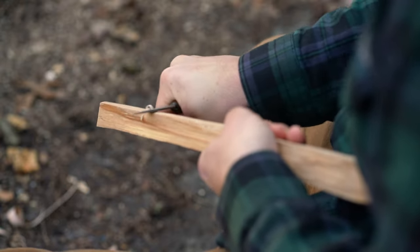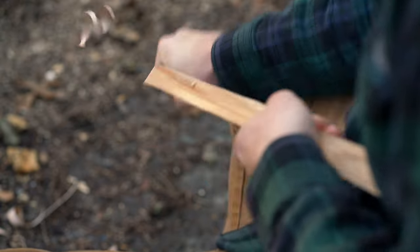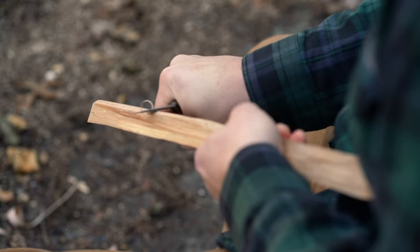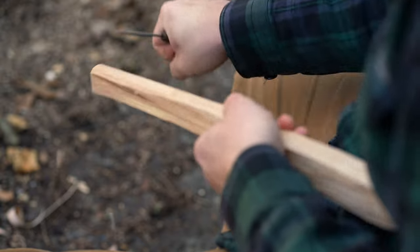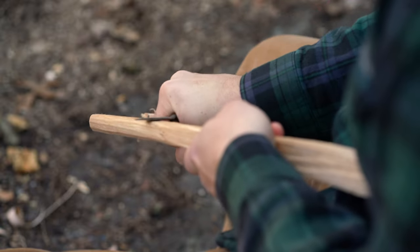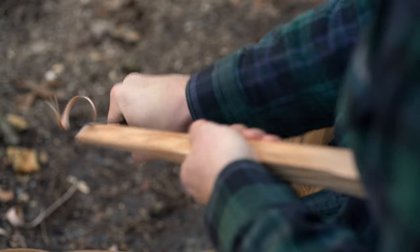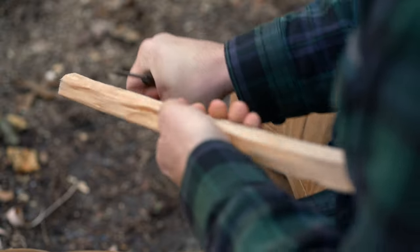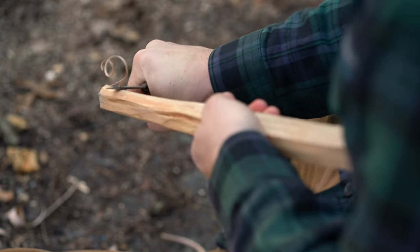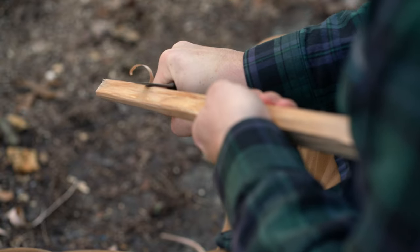A few things to remember: if you are struggling to make your cut, chances are you either have a dull knife or you're trying to take too big of a bite. So it should always be pretty nice and simple. If you're struggling, stop and assess and see what's amiss. With this cut you can really lean into it and take big cuts, or you can go smaller. This is really for just removing a bunch of wood at once to get your initial shape.